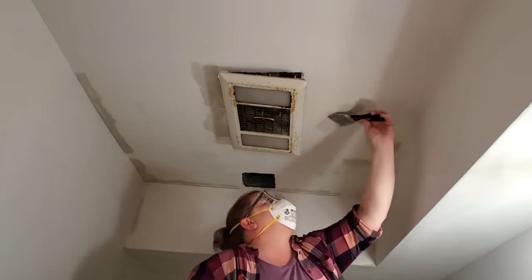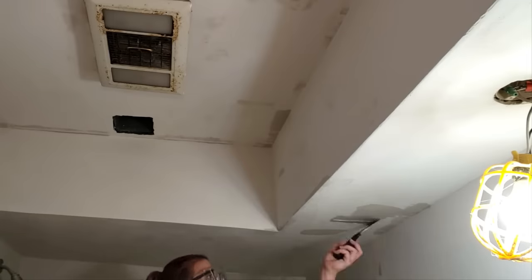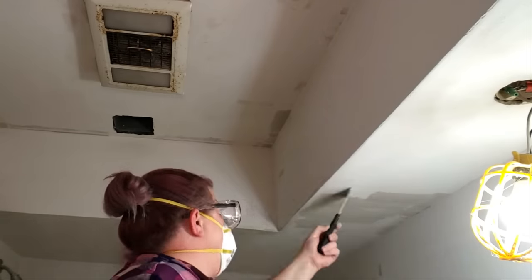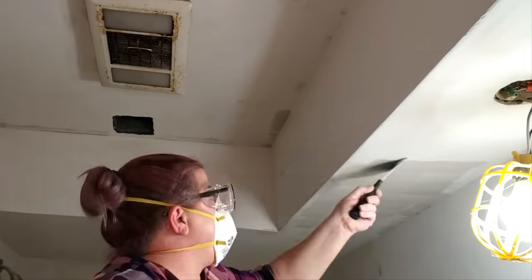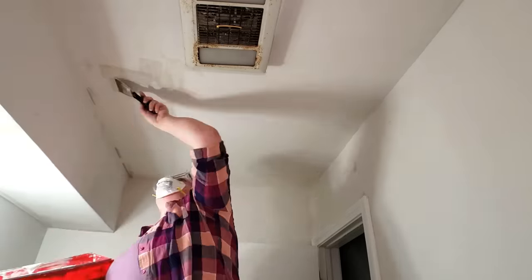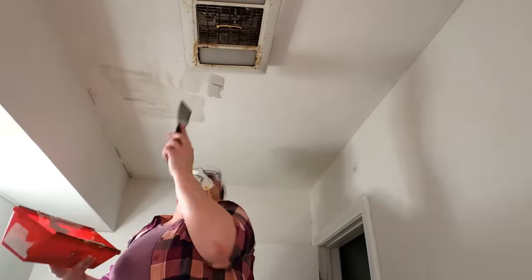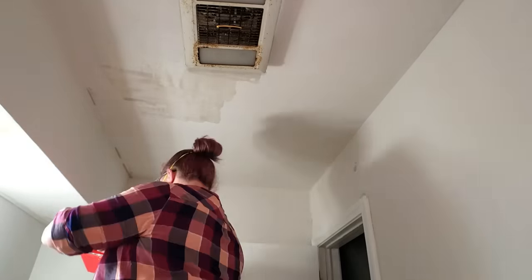This time, you're not adding another layer of skim coat though. You're just running that taping knife over the surface, filling in the holes, and then going back over them from opposite directions using a firm hand, making sure that that joint compound is pushed all the way into those holes while also scraping off any excess material that's on the surface of the ceiling. I also used this time to touch up the corners, but again, I'll be covering that in my next video if you're interested. And if you see any other imperfections or any other spots that you missed, this is the time to go ahead and fix those.